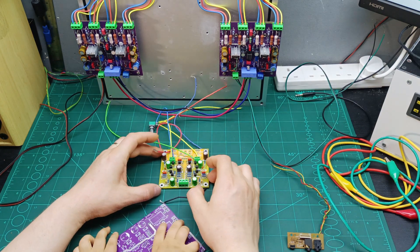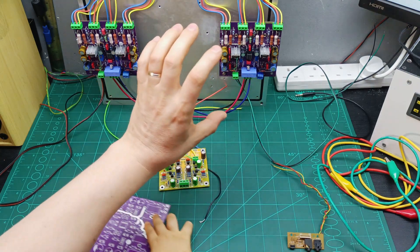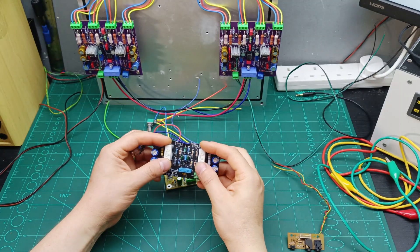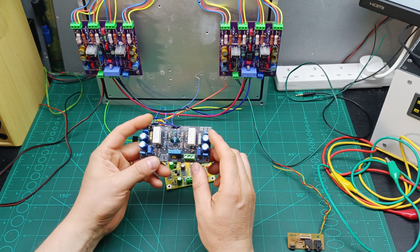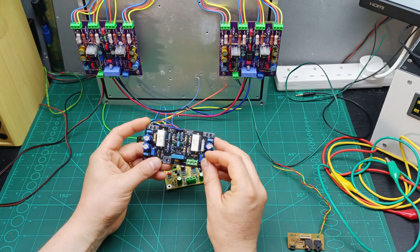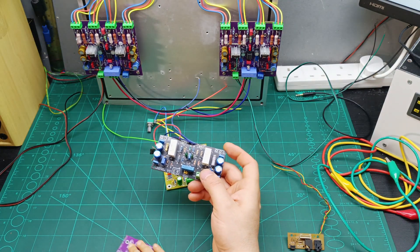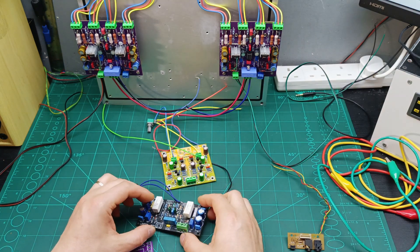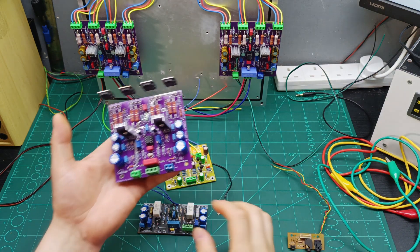For the sound test I'm going to use my single-ended class A amplifier — my own design. The first step was testing on the breadboard and it was running really nice, I was impressed with the sound. This was the first version where I ran into issues like thermal runaway, because from the moment I was powering on to the moment the transistor was getting fully warm, it was giving me about 80 millivolts of DC offset on the output. So I scratched my head around it and came up with a DC servo to fix that issue.